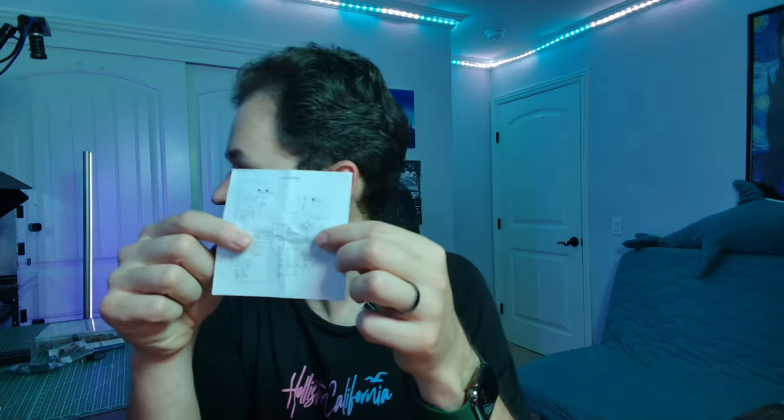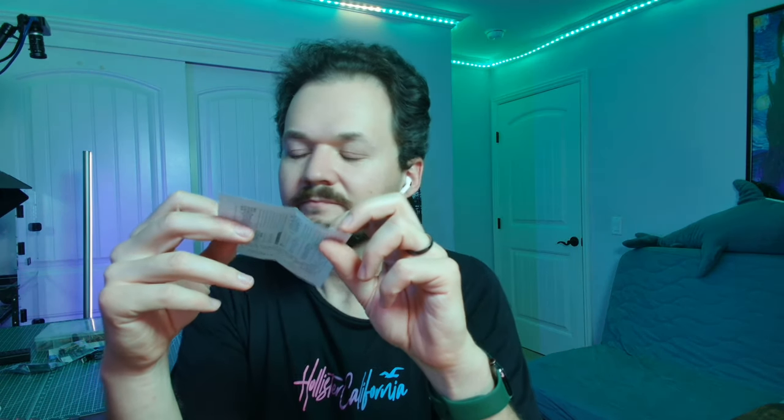Okay, so what is the plan? We have here some pins, right? If you look at this schema. Anyway, we will double check. So we have this schema, but to control it, we need to send from 4.5 up to 5.5 volts, right? So this is like an Arduino task, of course. We need to send these signals to play one of the melodies. So probably we have here like 8 melodies. 1, 2, 3, 4, 5. Yeah, we have here 8 melodies, right?